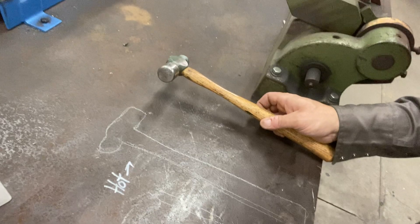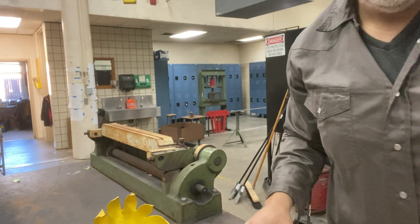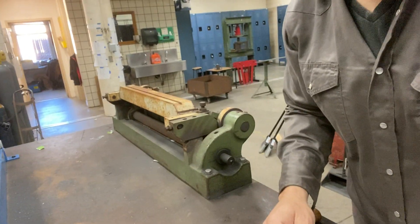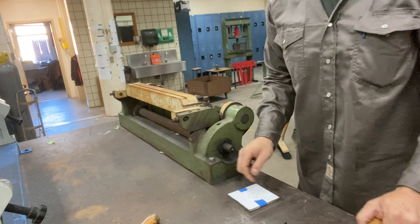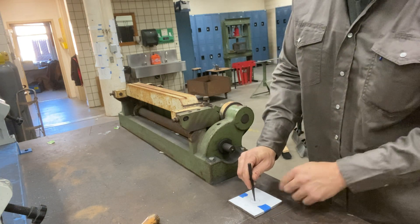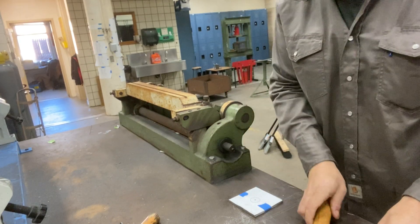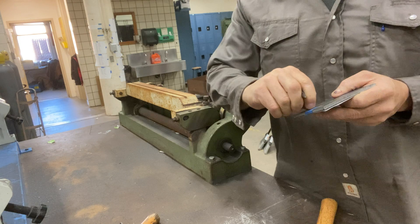Notice there are little outlines so you know where to put them when we clean up. You're gonna take your piece of metal and with the center punch, put the center punch where you need to drill the hole. On this die I'm putting the center punch in the middle of the little circle. Then take your ball peen hammer and give it a good whack. The purpose of that is the drill bit will go into that hole. Then take the paper off.